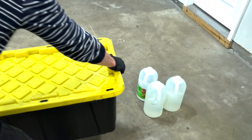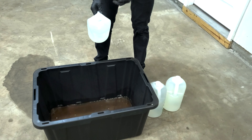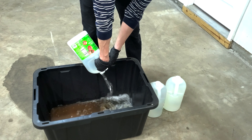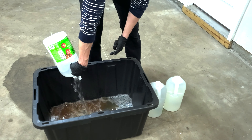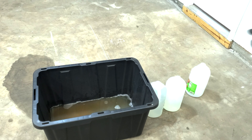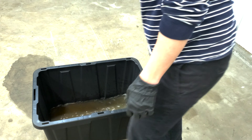The first method doesn't involve a grinder at all — it's simply using household white distilled vinegar. Vinegar is one of those miracle fluids people find all kinds of uses for: cooking, cleaning, disinfecting, and even getting rid of rust. One use you may not have known about is that, given enough time, it's great at removing mill scale while leaving the pure metal beneath intact. Some people use stronger acids like muriatic acid, but I prefer vinegar because it's not as dangerous to the skin and lungs, it's cheap, commonly found in grocery stores, and given enough time it works just as well.